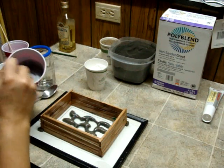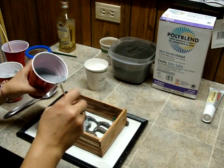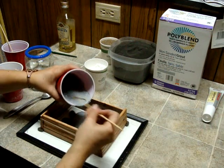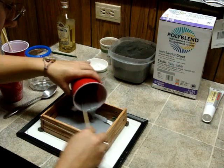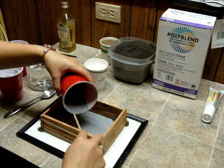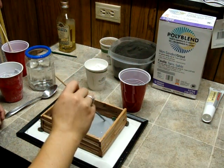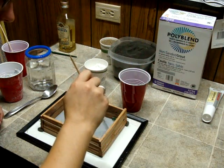Easily patched, but just a bit unsightly. When pouring, we're going to try and pour directly onto the surface. We're going to use the skewer to make sure it gets into all the little nooks and crannies. Always pour on top of what you've already poured before, because that helps prevent air bubbles or any little pieces where you trap oil. Keep mixing as you go — the Perlite likes to float to the top, so mixing just keeps it incorporated. I use small cups because I would rather mix two or three batches than make a batch that's too big or the wrong consistency. I'm just leveling this out a bit, as I find non-sanded grout is much easier to clean than sanded grout.